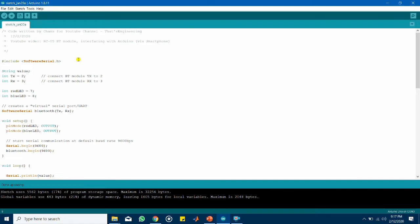This is the Arduino code written for this circuit involving the Bluetooth module controlled via a smartphone app. A link to the code will be in the comments below. The code starts by including the SoftwareSerial library. The variable 'value' is of type String and holds the data sent by the Bluetooth module to the Arduino. The transmitting and receiving ports are specified as pins 2 and 3. You can use ports 0 and 1 instead as they are the designated serial ports for an Arduino Uno, but you would need to disconnect those wires every time you upload new code, since the serial ports are used during upload.